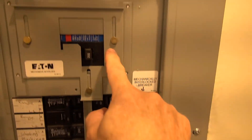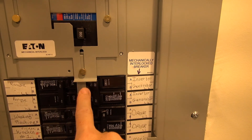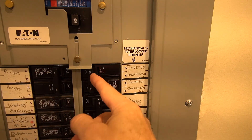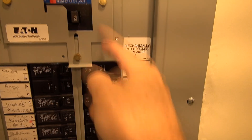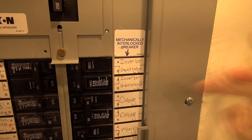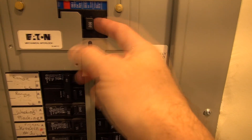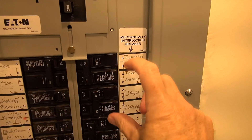The way this mechanical interlock works is you can only have one breaker on at a time. That prevents the outside connector from being live when it shouldn't be, and stops you from having both this and a generator on simultaneously — which would feed power into the generator out of phase and potentially back-feed energy from the generator into the grid, risking linesmen. This is why the interlock has to be installed up here.